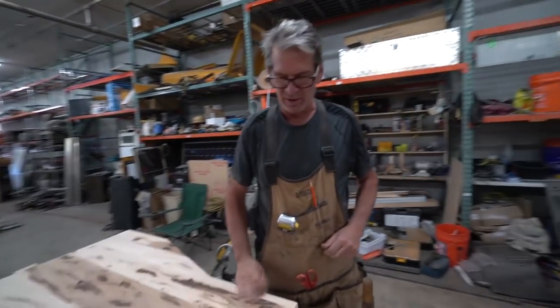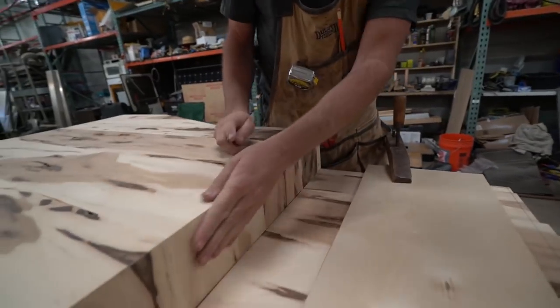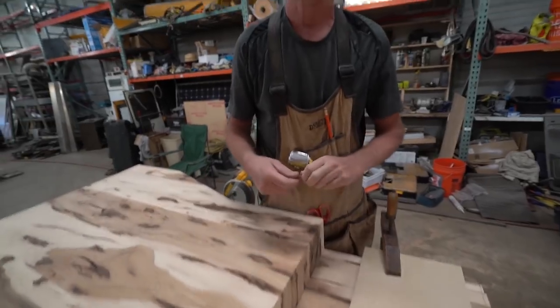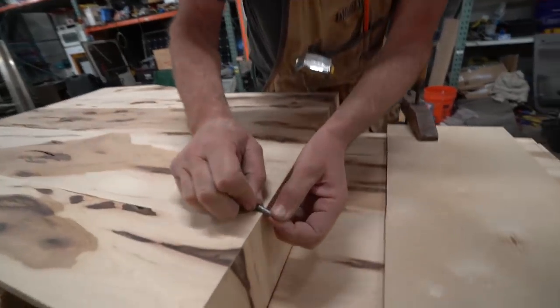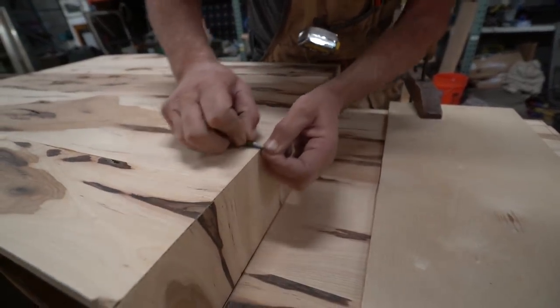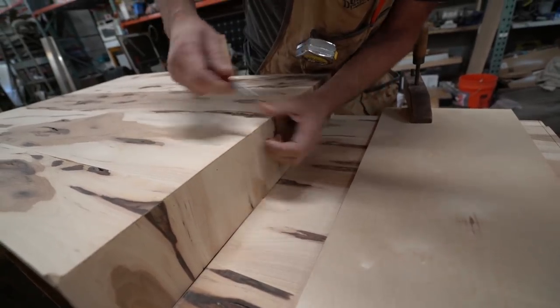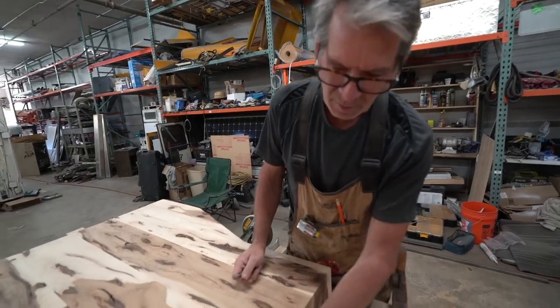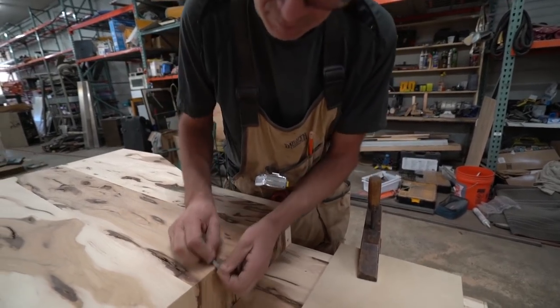Eric, what's going on in the wood shop today? I have a little bit of a gap at my joint here. One of the ways to fix it — besides just filling with material — is called burnishing. You take a tool similar to this and work it in along the edge of the joint points. It kind of pushes it together and essentially closes up those gaps. It works better with hardwoods like this because it stays where you put it more or less. It's a way to help clean up a corner that might not be as pretty as you'd like.